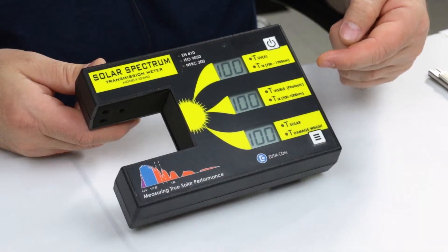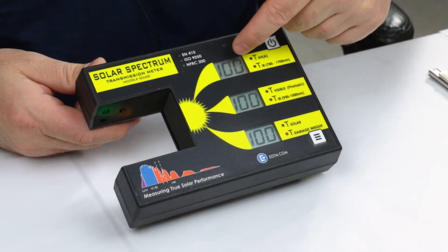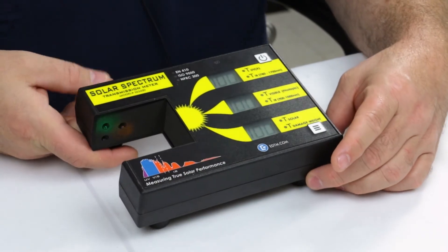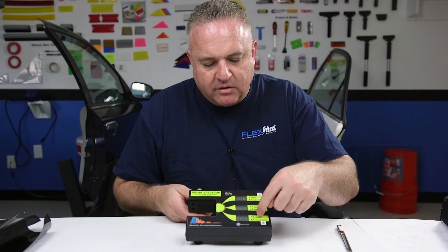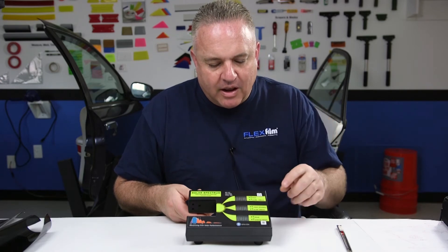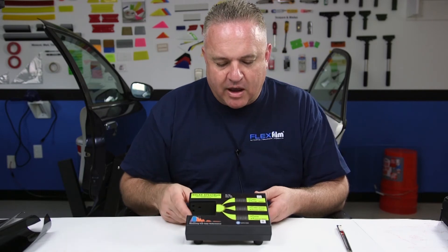This number in the middle can be a joke sometimes, sometimes it can be right. It's like trying to find out who's going to win the game by only giving me the score in the first quarter. The broad-spectrum window gives me the score at the end of the game, so I'll know what's going on. This last one is that damage weight — a number used to determine how effective window films are when you put them on houses. The solar transmission, T-solar, is the one I showed you earlier, which shows how much solar energy goes through — not to be confused with solar heat gain coefficient, which involves convection and conduction data. This is simply solar energy and how much of it gets through. I don't do much with the last one, but a lot of people depend on it for data when they're selling film.